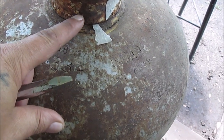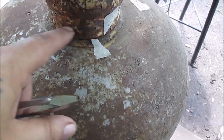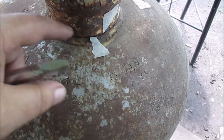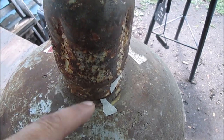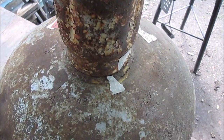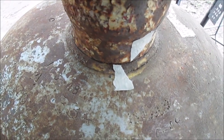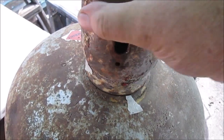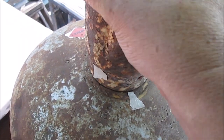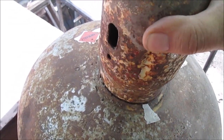The spray will boil the rust out - even soapy water, anything to break the rust free. When you're heating, put heat to it and cool it, spray water - the water actually helps get stuff out. We'll continue tapping on it. We may go get our pipe wrench and see how easy it'll come off, but it is on there pretty hard. It has moved about an inch though. Okay, that broke it loose - you can tell it's pretty gunky, so I gotta keep working it back and forth.